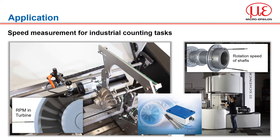The development of electric motors has seen a new requirement for speed measurement to ensure the correct balance of rotor and stator — any imbalance leads to excessive loads and reduced life. In these applications, materials used are often not suitable for eddy current sensors, so MicroEpsilon developed the new CST6110 capacitive-based system, which is able to measure on a wider range of materials. Whether electrical conductors or insulators, they are counted from the first detection with no run-up necessary and without impairment of signal quality. Capacitive sensors can also operate in both very high temperatures and the electromagnetic fields present in any motor.